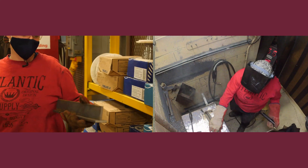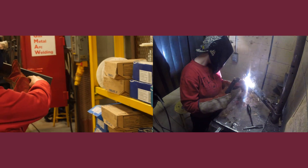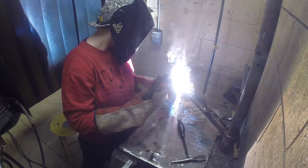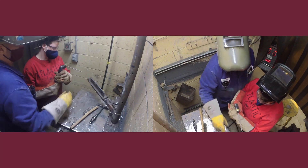To minimize distortion, you're gonna put your first bead here and go across, then do it on the opposite side, and then you're gonna back step it right into your welds. So put one at the bottom and then we'll put one at the top.